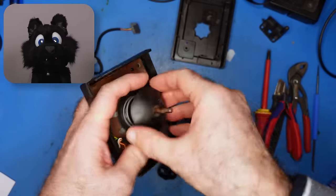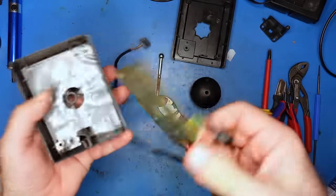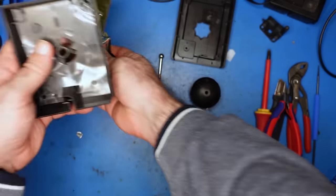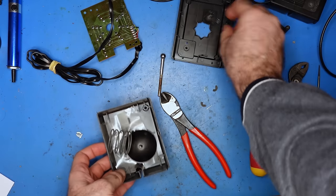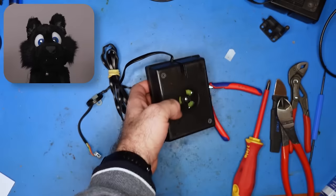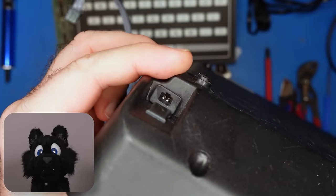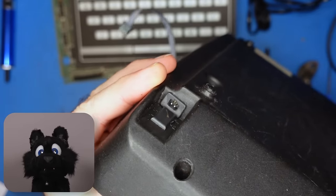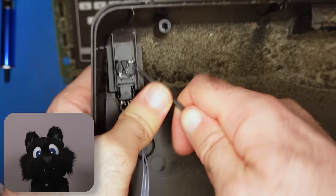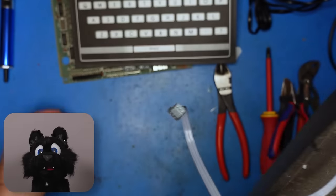Once the stick is removed, the PCB comes out and the whole lot can get a good cleaning in the sink. The second joystick is missing the bottom cover. The power socket is a weird one — I think it's the same type that was used on the plotter I restored a while ago. Time for a replacement! I undo the heat-staked cover plate and make a new one that includes a hole for the regular barrel connector.